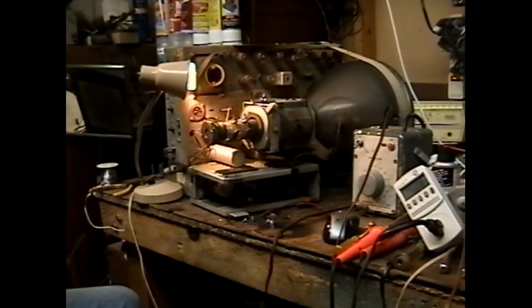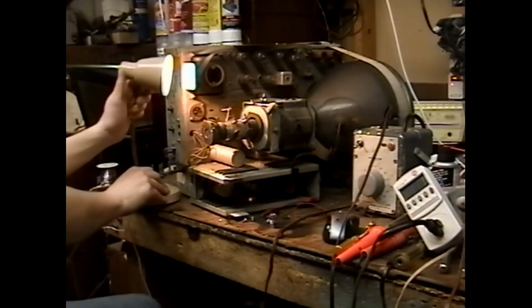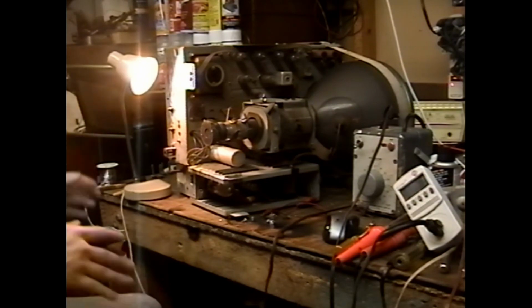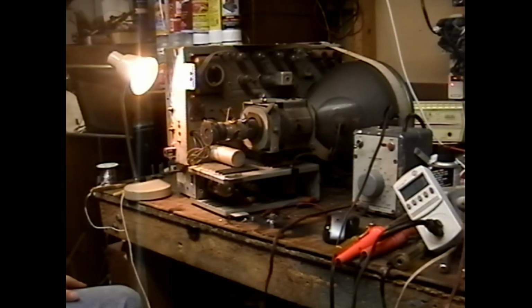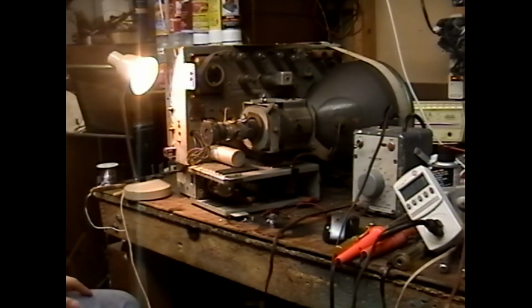He's dead, Jim. Let me give you my autopsy on this set, since it's clearly beyond what I can restore and have looking anywhere close to proper. Basically, that rattletrap 5U4 power rectifier tube that used to be plugged in here, at some point it burned out. It probably burnt out because one of the electrolytics in the set was probably badly shorted and causing the tube to red plate. The tube probably drew too much emission current. The heaters probably melted apart.